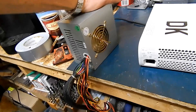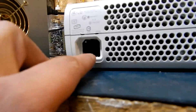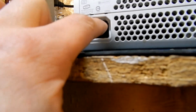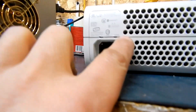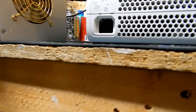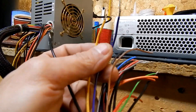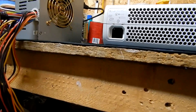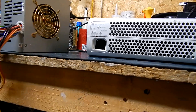It still works without a load — some of them can be problematic. On the socket, the bottom is your negative, the tops are positive, and there are two hidden pins at the very top. The one on the left side you leave alone, but the one on the right side is the five volt standby. So the purple wire is your five volt standby on the ATX power supply, yellow is your 12 volt, and black is your negative.